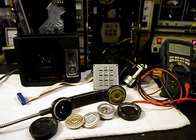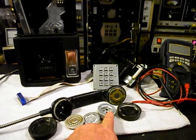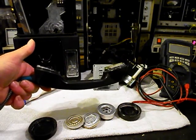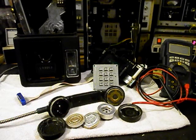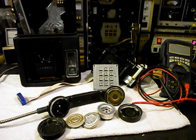We also want to give you a look at the handset. We've had to remove the cap on both ends and replace our receiver capsule and our transmitter. The units that were in this were no good. If you know anything about payphones, they actually glue the caps on the transmitter and the receiver, and if you've never taken the cap off of one of these receivers for a payphone, it's not simple — you have to know how to remove them, because you can basically ruin your caps if you don't have experience. So if you've never tried it before, it may not be a good idea.